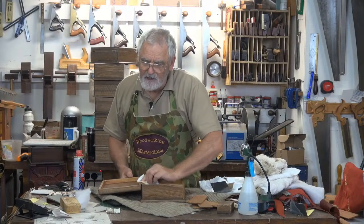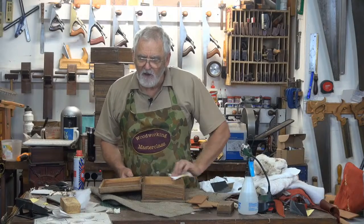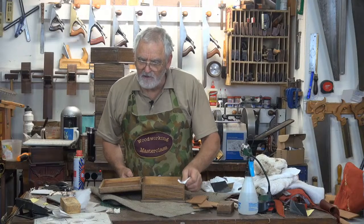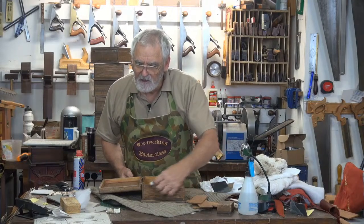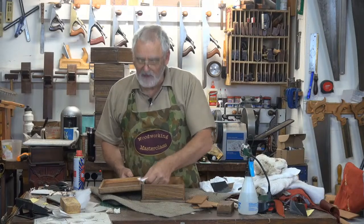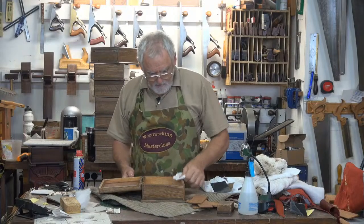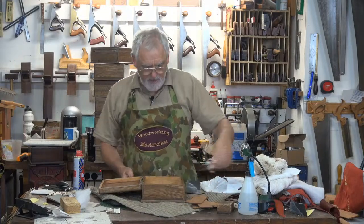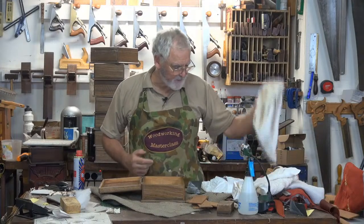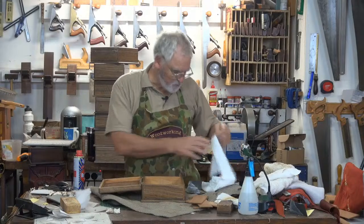John, I imagine there are heaps of possibilities, but any ideas why my number 7 and number 5, see, I'm dyslexic, your number 5 and your number 7, both cut stuff like Oregon, but feel like they are skating over a piece of Jarrah I have? I'd reckon it would be the angle at which it's sharpened. What angle do you sharpen it at? If you can tell me that, that would be muchos good.